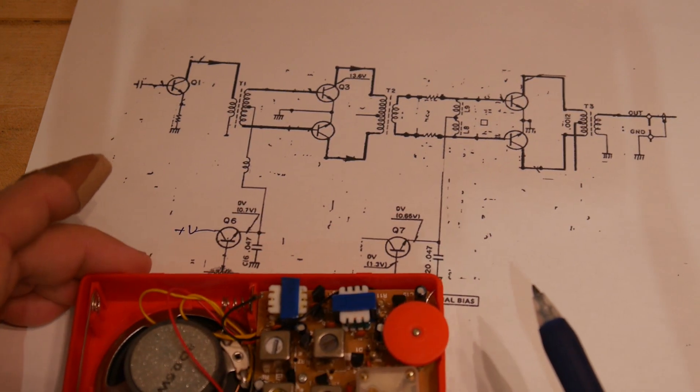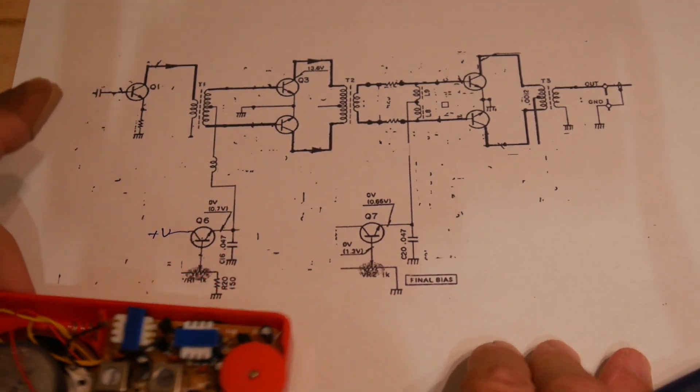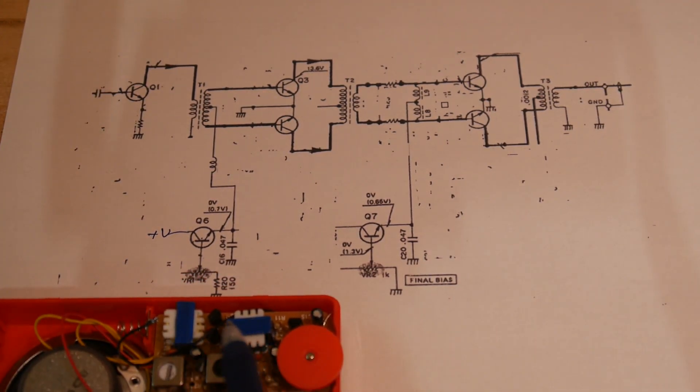What's going on here is this is exactly the same circuit as our little transistor radio. I guess good ideas are good ideas. I'm not really sold on the idea that you had to do it this way in a little 7-transistor radio — that you actually had to have two output transformers — but that's what they decided to do.